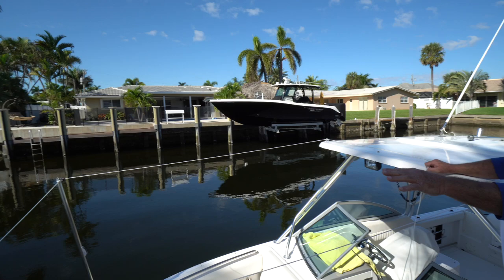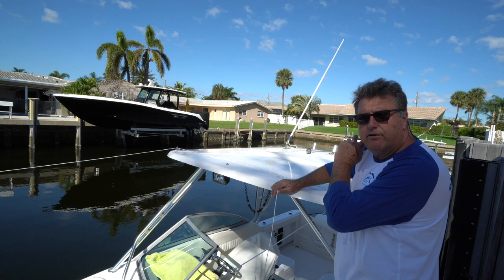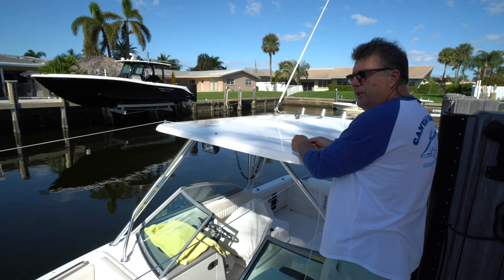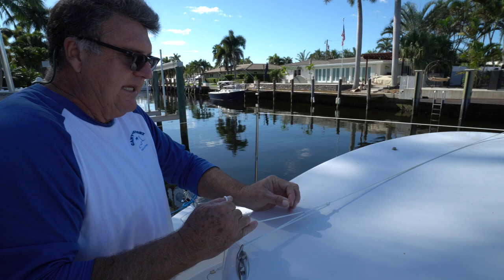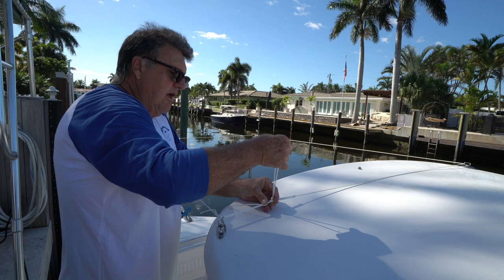After we've determined the height of the forward poles and I've shipped you your poles with your custom padded bag and your mounts, and I send you the mounting hardware and the rope, this is what I'm gonna require from you. You tie one end off, you go from pulley to pulley, back to mount, and then when you get to here, you put a little loop in here, and you pull on this. And when you think you have it tight, pull it some more. You think you got it tight? Pull it some more. I want this thing tight, tight, tight. Super tight to where you think you're gonna pull screws out or something. I want it super tight. Otherwise your sail shade won't be able to be tightened up.